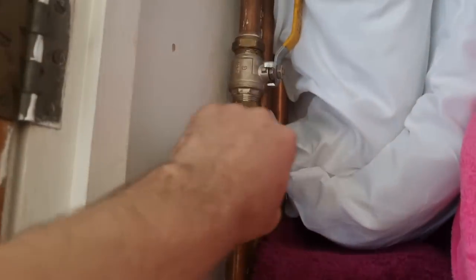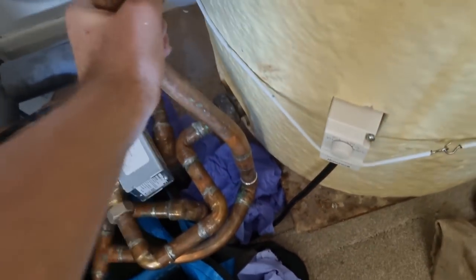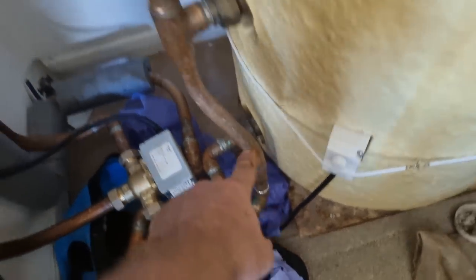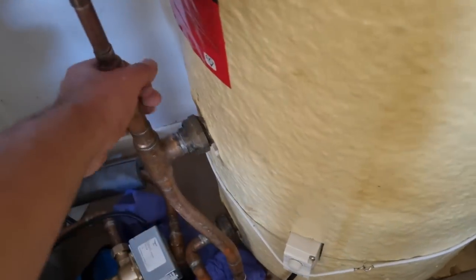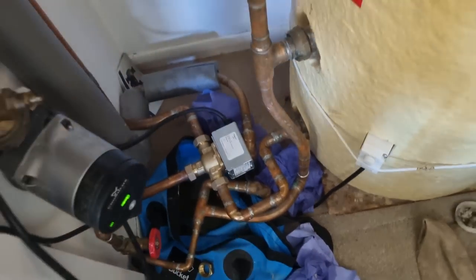And then we'll bleed the air out of it. Right, I'm just getting all the air out of it. That heating flow pipe, I think it goes up into the roof, but I've just let it go on heat and I've turned the hot water off on the cylinder stat just to blast it up, and you can hear all the air gurgling in the radiators. We didn't lose that much anyway. So the hot water's off. I know they've piped it in on the return. Ideally it would have been better to come in on the top of the coil, but we can only work with what we've got. Where do you stop on a job sometimes?